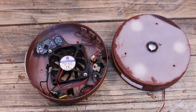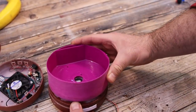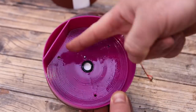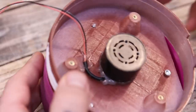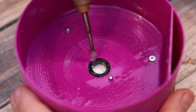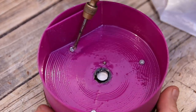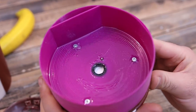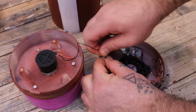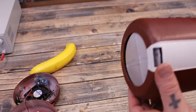By now the other part with the resin should also be dry. Now we have to place it on top and make sure that it is water sealed. We add three screws and tie them from below with some nuts. Then I make some more two-part epoxy and place it all around the mist generator module. Also we add some more epoxy on top of the screws in order to make this entire container water sealed. So now finally everything is dry and ready to go. We can connect the mist generator to the button case with the electronics. Then we can also glue in place that silver part on top of the capacitor from the inside. So now it looks a lot more like a capacitor.